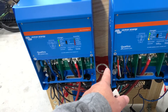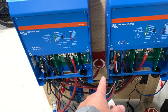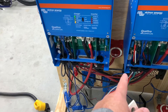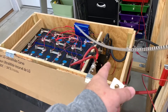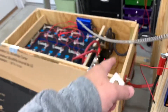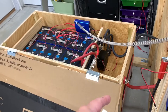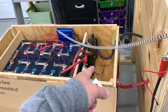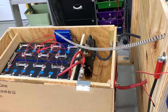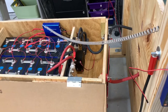What I had seen before — and this behavior is inconsistent, which is even worse — is that even with the DC contactor turned off, when I move the switch from off to position two to connect battery two, I get a pretty good spark. That's not supposed to happen. There's not supposed to be enough current flowing when you first do that. That's the whole point of a pre-charge circuit — to avoid that spark, which is destroying my switch.